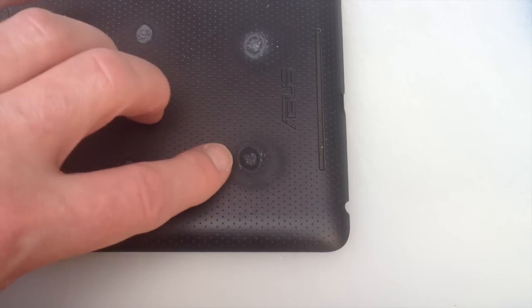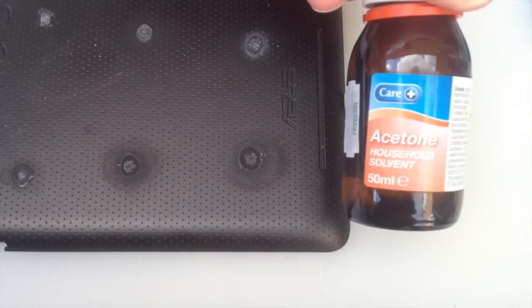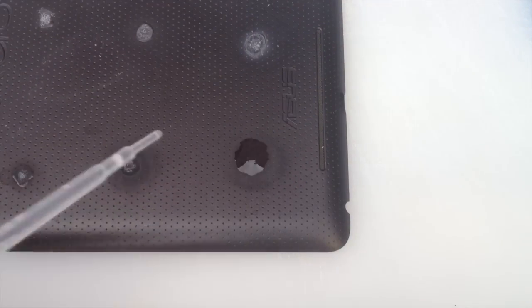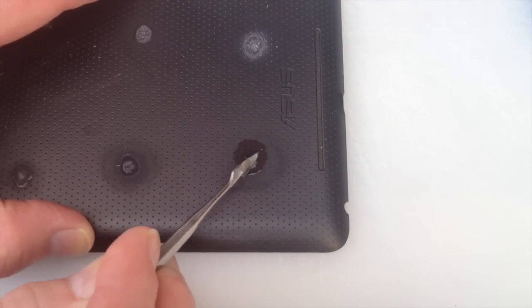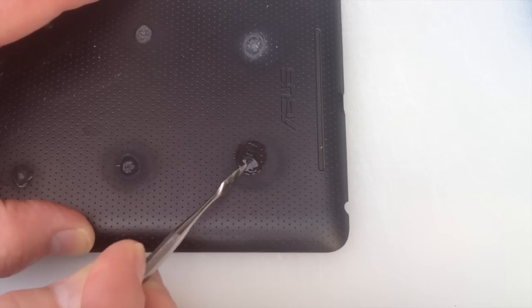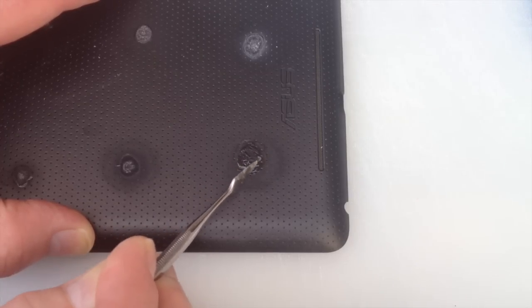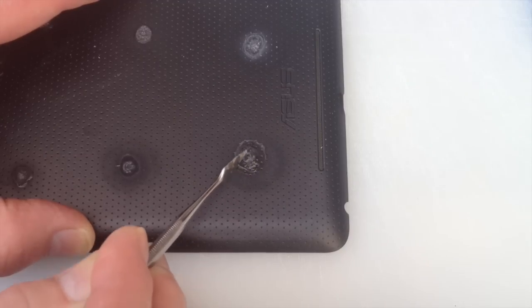Hi there, this is Fixed It. We're still looking at the super glue on soft rubber plastic surface experiment — we're now up to dot five. I'm going to apply a few drops of acetone. Okay, we'll have a go at scratching away, and as you can hear and see, the super glue is still quite rigid but interestingly it does seem to be softening up.